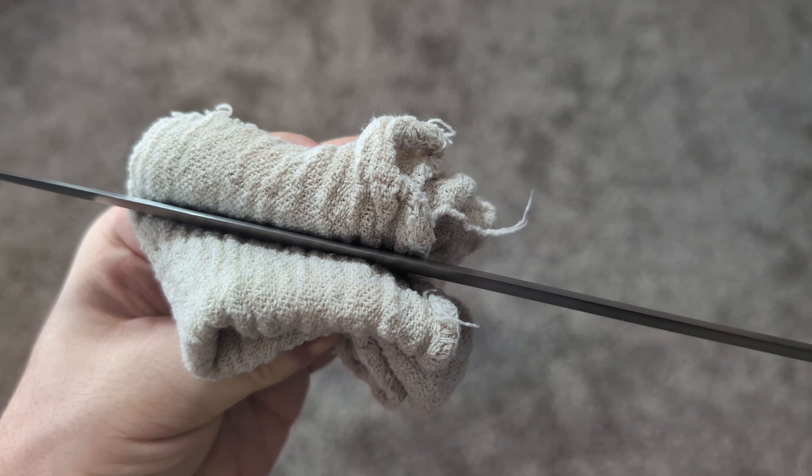It's a little bit of a not particularly great distal taper. It would work better, in my opinion, if it was more linear throughout and got down a little bit thinner out towards the tip. It's not bad, but it could be refined some. There is not what I would call a ricasso on this sword, but there is a good six inches where it is unsharpened — that's just an unsharpened part of the sword. After that the sword is sharp, with no secondary bevel — the edge is blended into the rest of the blade.